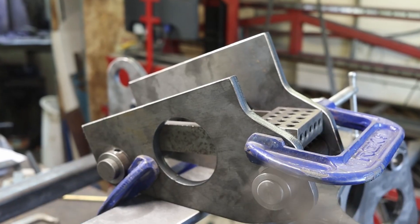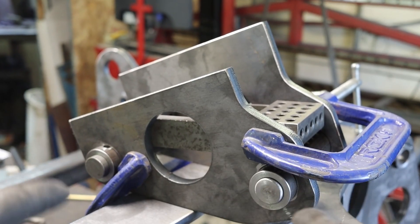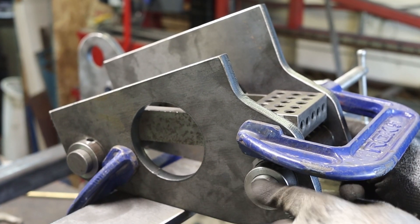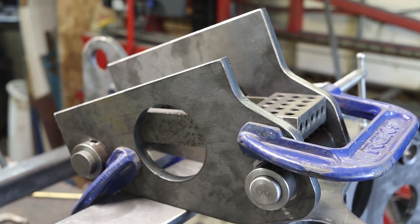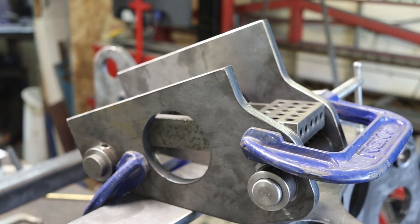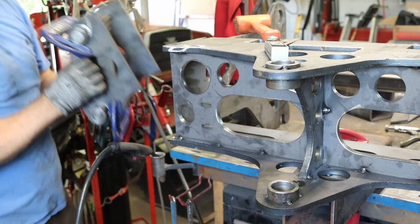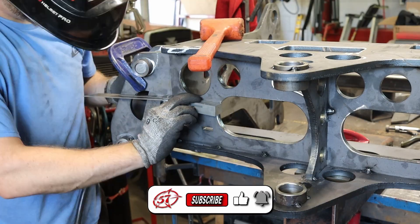For the other side I changed my approach — the bottom face of those two brackets are perfectly aligned, same thing with the bushings. So I clamped everything together on a flat surface and everything lined up perfectly. What I'm trying to do is weld that unit in, and hopefully it's gonna be quicker and I will still have that 20 degrees that I need from the front plate of that backhoe base. Hopefully everything once welded will be exactly where it needs to be. Right on the money.